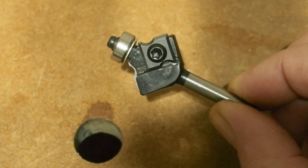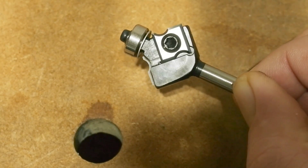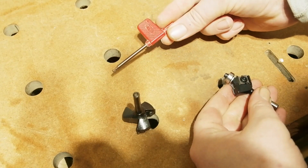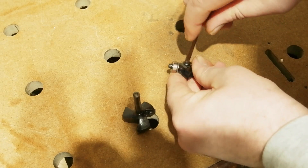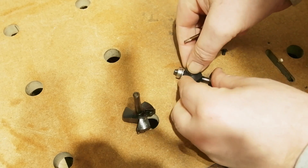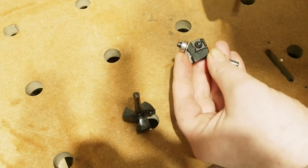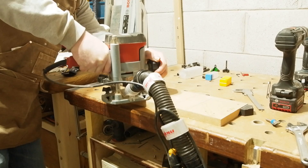Let's kick off with the two-in-one round over and chamfer bit. These are available with a square blade set only, making it just a chamfer bit, but this one has a cut-away for a round over — 6mm I think — on opposing sides, as well as two straight-bladed sides. All the Banggood cutters came with a Torx bit for removing or turning the blades. Turning is easy enough if a bit fiddly, and like all these bits, the body has a seat cut into it to perfectly align the blade when reinserting. With a turn of the blade we've gone from a round over to a chamfer.